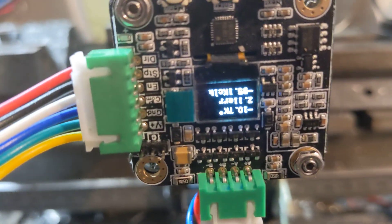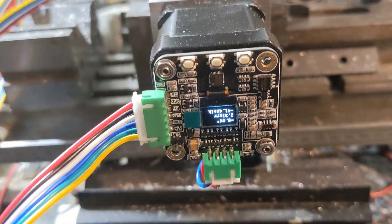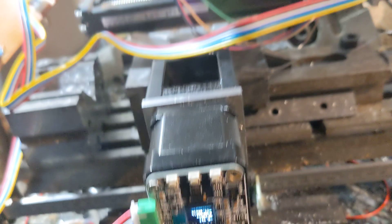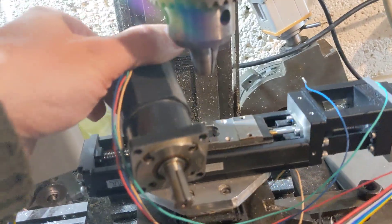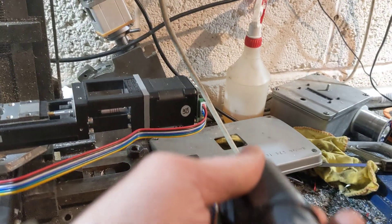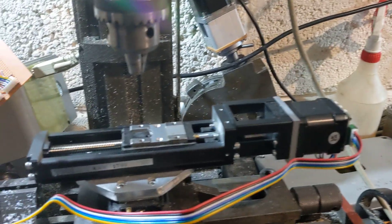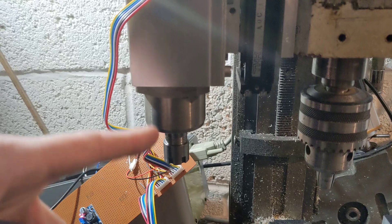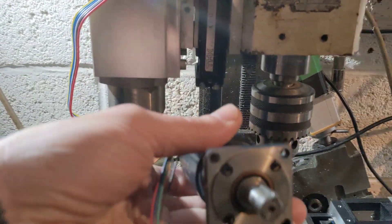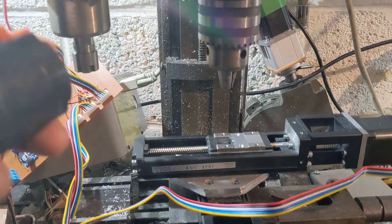You can just about see that move in there — you can just see the thing turning. It's super quiet, super accurate, quite fast and quite powerful. This motor here is going to be a rotary, so we've got XYZ: this up and down here which has got the spindle motor in, and this will be a rotary table that's also synchronized — so we've got four axes: XYZ and the fourth axis.